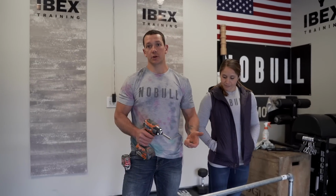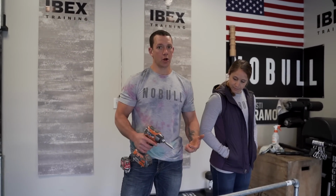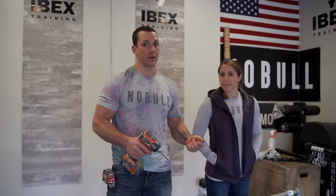All right, so I've got my joist marked on the ceiling, and I do want to lag this up there so that it's really strong. But to make it easy on me, I'm gonna screw it first to kind of hold it up there, and then I'm gonna add those bolts. And I'm even gonna put my screws in now. I'm gonna start them so that I don't have to hold it and fidget with it while it's up there.